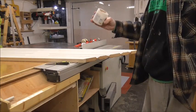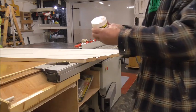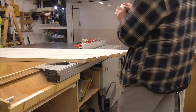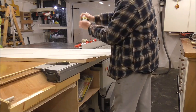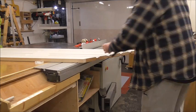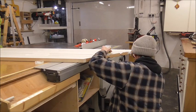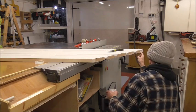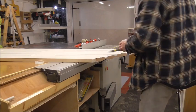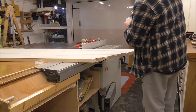The filler I'm using - I've got a few different types and colours. This one's just a plain white and as you can see it's a premium grade filler, pretty good stuff. Just force lots into the gaps. That shouldn't take long - leave it half an hour or so and it should be well ready to sand down.